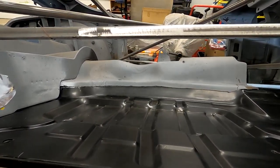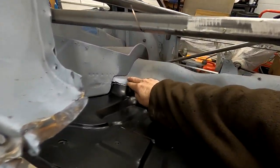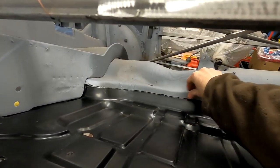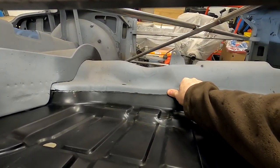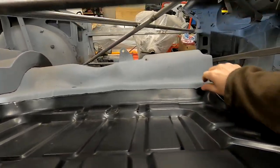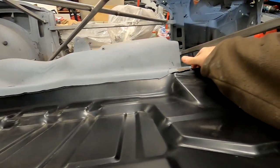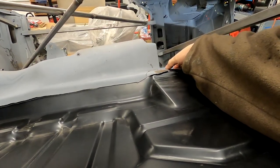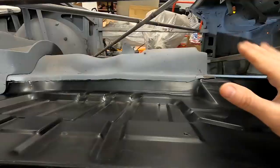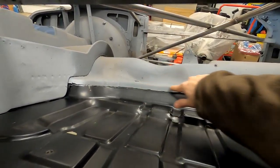That's kind of what the struggle has been with this big line: how do I cut this perfectly and end up with a nice butt weld? On the other one, I did it by measuring, then cutting, then refitting, and then finding I had a gap in some areas because my measuring wasn't perfect. That's a really tough and time-consuming way to get it perfect, and we really did take a lot of time on that other one.